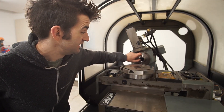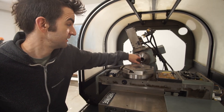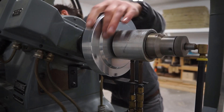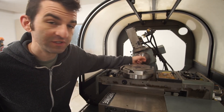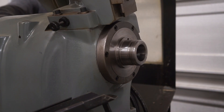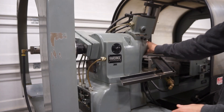The next step was getting the collet out of the taper. It was cinched in there quite well. On the back there's a pneumatic driven collet closer, but if I loosen a couple of screws I'm able to actuate it by hand. So I basically just decoupled it and spun it by hand to remove the collet. I just wanted to check the taper to make sure there was no pitting or fretting or anything weird. And once again, it's nice and smooth, covered in oil — no signs of rust or anything. I'm very happy with that.